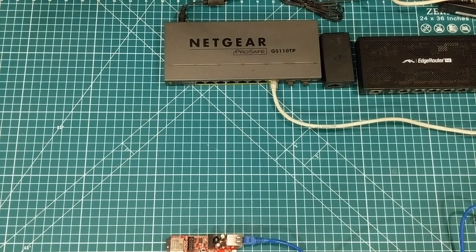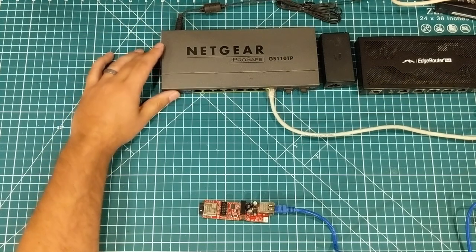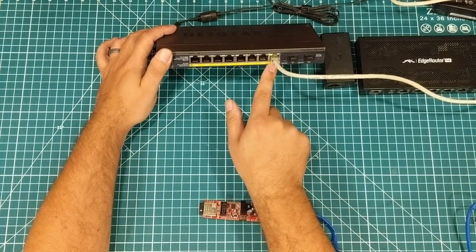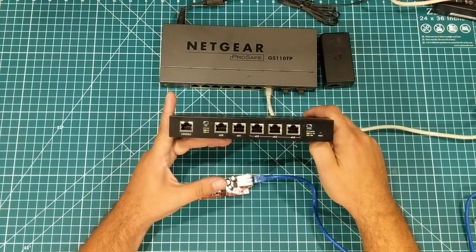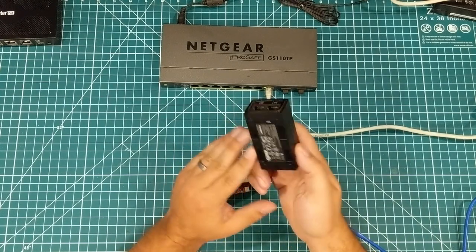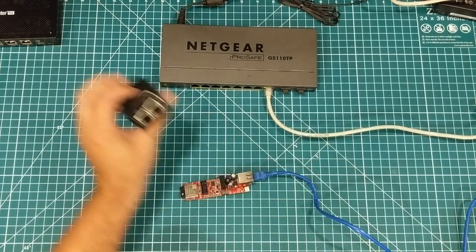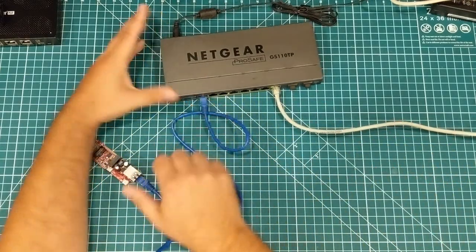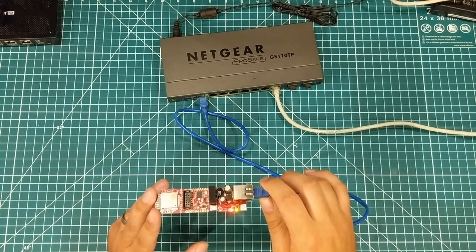I grabbed a couple of components. This is a PoE switch — basically this wire is just going into the network jack on the wall, and every one of these ports can supply power. If you don't have something like that, this is a PoE router — some routers have ports that can actually supply power. There's also things called PoE injectors; this one is a 24 volt one. You've got one wire that goes back to your LAN and another that goes to your device. What makes it so great is that if you're going to take the time to run Ethernet, you might as well have it also power the device.